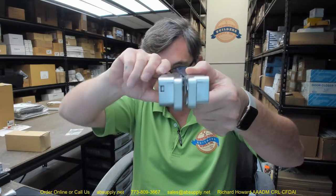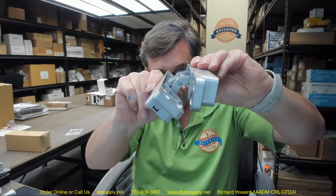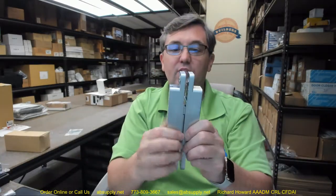One important thing: the center line of the pivoting axis of this hinge actually floats through the opening as the door moves. So that vertical pivot axis is not fixed — it moves through a slight arc. If you are using this hinge with overhead stops, the stops need to be quoted and manufactured with proper templating based on this hinge's floating axis. Every major manufacturer of overhead stops can apply that templating for you, though I have found they cost more.